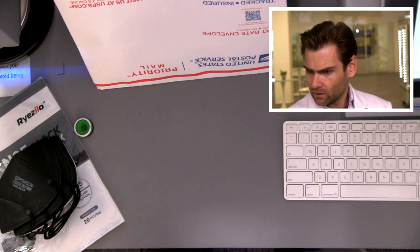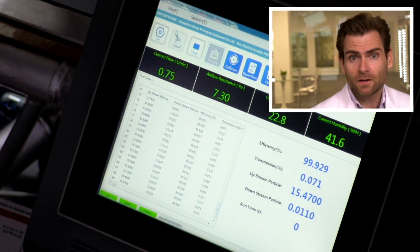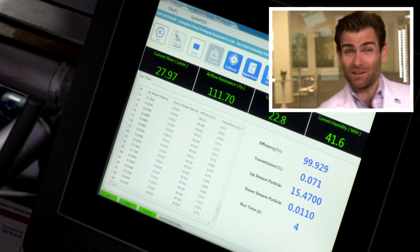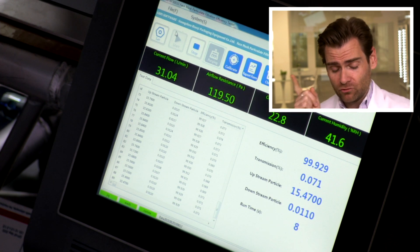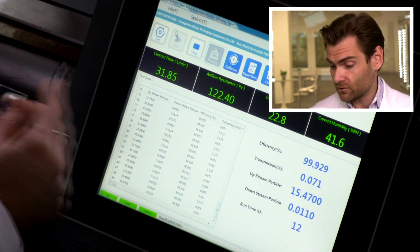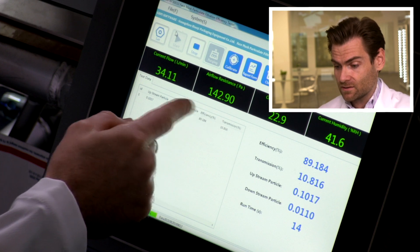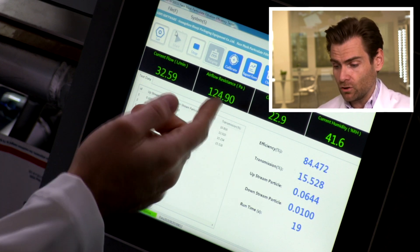Let's put it in the clamp. The results should be almost exactly the same as before. It's a PFE machine — particulate filtration efficiency machine. If you want to find out more about how this works, check out the link; it covers how our setup is a little different. The first thing we're going to look at is airflow resistance — it's going to be a lot higher for an N95. This is actually pretty good: 125.